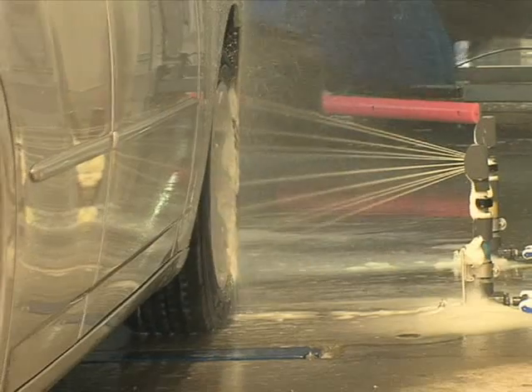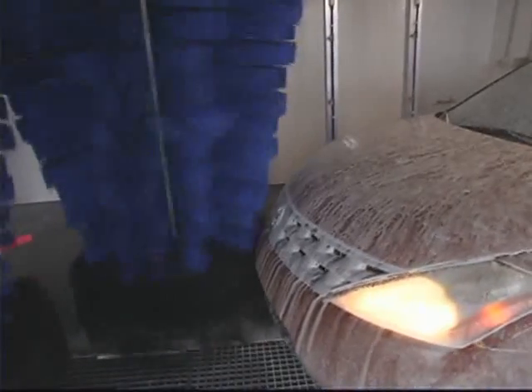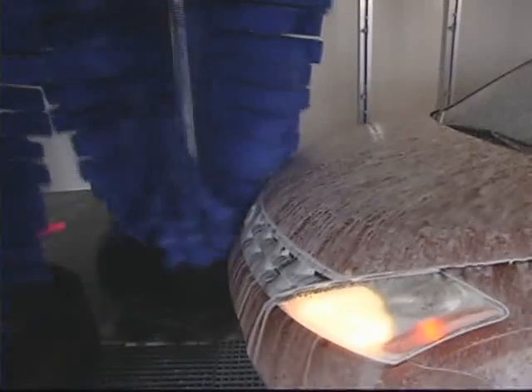The unit comes with the 8-foot correlator. It comes with a 50-foot conveyor utilizing front wheel pull. When we do that, we maximize our conveyor length. We've got our entrance management system with a set of photo eyes and a tire locator switch that'll tell us where the tires are so we can efficiently and effectively apply our wheel cleaner. We go into a set of reverse wraparounds.